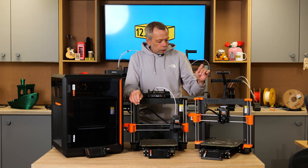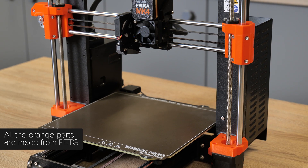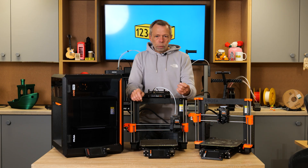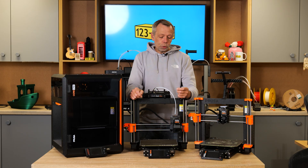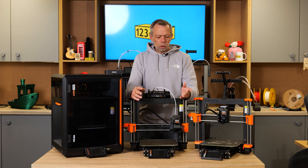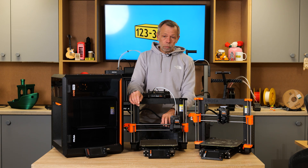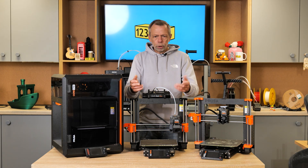There were some other parts on the machine that were printed predominantly with PETG. For those of us feeling the need to have our printers enclosed to print ABS, ASA or whatever, the PETG was becoming soft in the enclosure, causing issues. You would end up having to periodically retighten your belt on the bed. I had problems on my previous version constantly tightening up the belt on the X-axis — the teeth kept slipping through the PETG printed part.